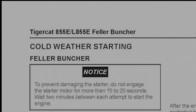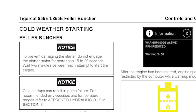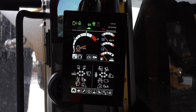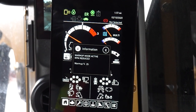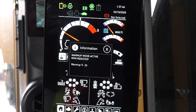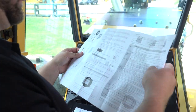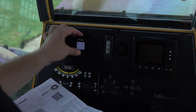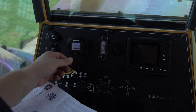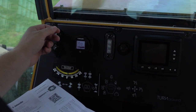The amount of warm-up time depends on the ambient temperature. Check the machine's operator's manual for the correct procedure. If the machine is equipped with a warm-up mode, it can now be used. Always follow the hydraulic warm-up procedure in the service manual before starting work. For machines operating in extreme cold climates, a coolant heater must be used to preheat the engine coolant and hydraulic oil. Warming the fluids extends their temperature ranges for cold starting.